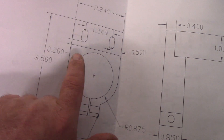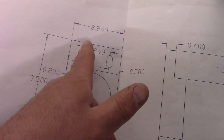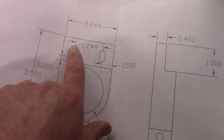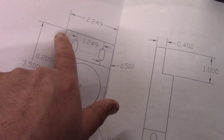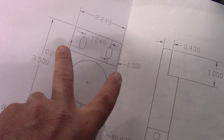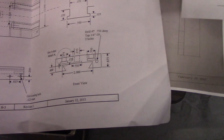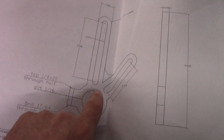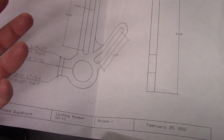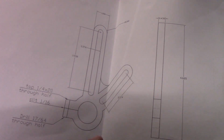My problem with these drawings is they're a little wonky. For example, a diameter is given as a radius. On the first part we're making, there are no size call-outs for some holes and no length call-outs for the elongated slots. I'm assuming it's 0.200 inches off this face to the edge of that hole, not the center. It's a little weird, so I actually had to go to the mating pieces to find out those are for quarter-inch 20 screws - which I upsized to 5/16 since the mating part is rather chunky. On this banjo there's also no size call-out for one diameter.